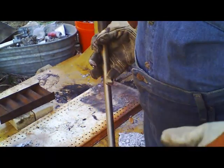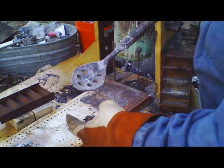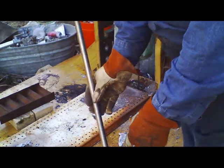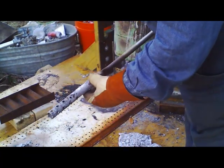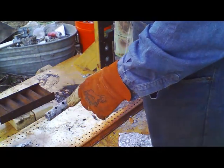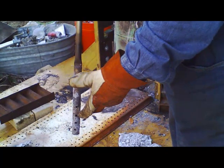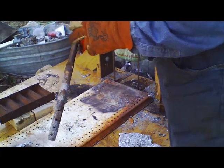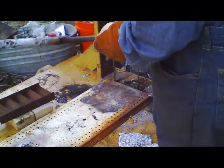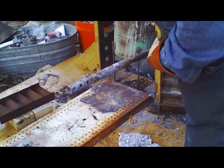I was telling you about skimming out the slag and all of the debris. Here's my spoon — it's on a four-foot stainless steel handle. Here is my degasser — weld it on the end. You put your baking soda wrapped in aluminum foil in here, stick it in the bottom of the pot, wait and watch for bubbles, and stir like crazy. When you're done stirring and there's aluminum on the degasser, don't bring it out and whack it on the side of your furnace — that's refractory. It'll break, and you'll say nasty words for hours.